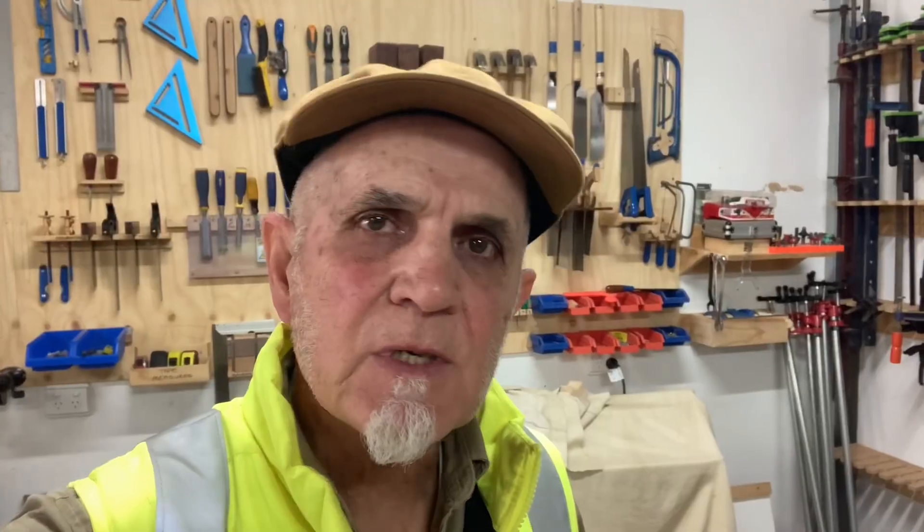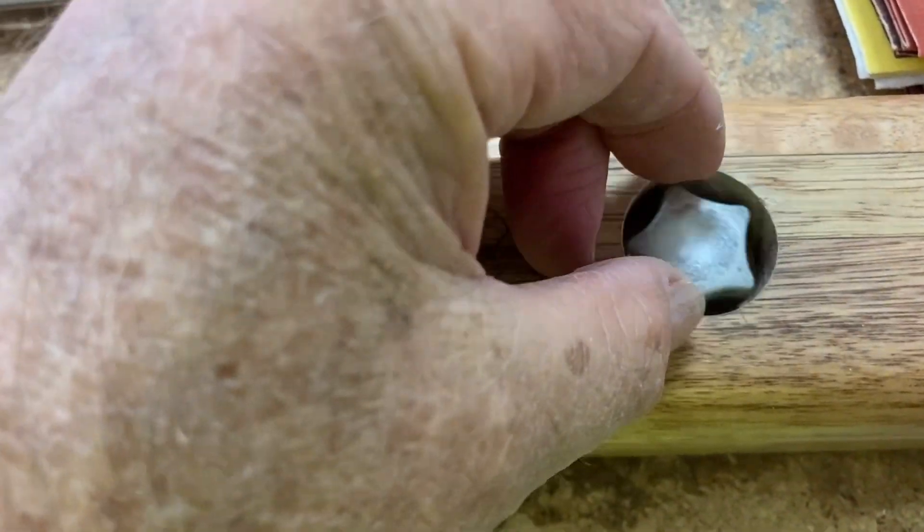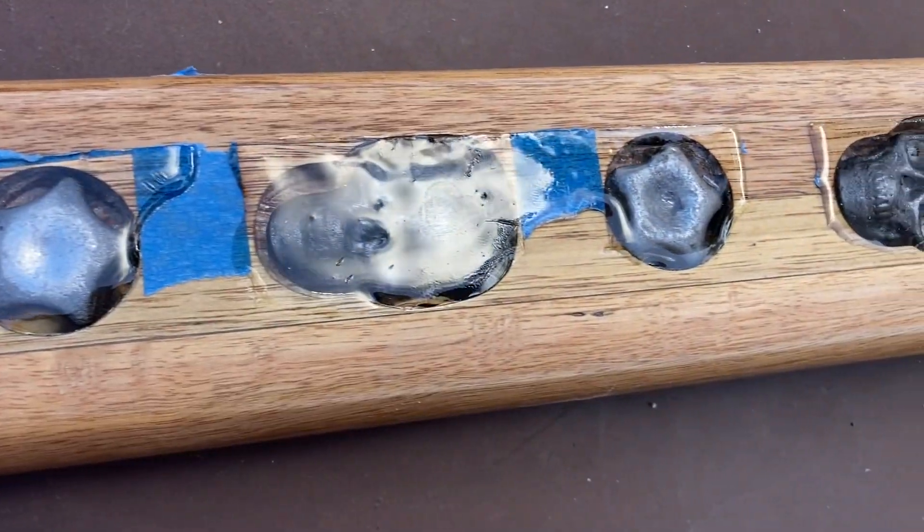Now the gun's been washed and dried I've brought it to the workshop. I cut the appropriate holes for the lead. For the star-shaped leads I used a round hole drill. For the skull-shaped leads I had to make a special jig which would fit the shape of the skull and then I could route it. I dropped the lead weights into the appropriate pockets and poured in clear embedding resin to fix them in there. When the resin had set I sanded it down flush with the surface of the spear gun. It looks a bit rough when it's just been sanded but after it's been fine-sanded and coated with varnish it'll become quite clear and you'll be able to see the lead weights without too much trouble at all.